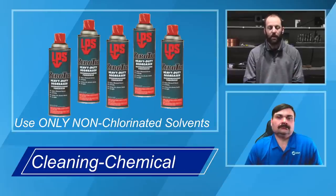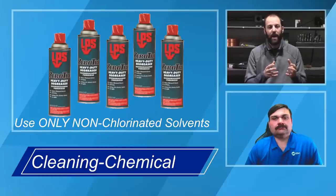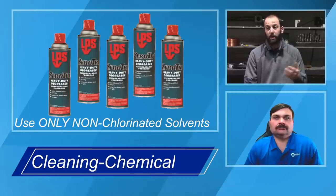They were still doing some of the mechanical cleaning things after the water bath in order to help ensure that the welds were successful. So there's always a trade-off of cost and risk that has to be weighed out in the preparation sequence. And for most companies, the cost of bringing in some sort of an acid and all of the safety protocols that come into play with that, and then washing it in a water solution, disposal of any of those materials, certainly is usually outside of the scope for your average company. And so therefore, some of the stuff that we're going to be going through today is a little bit more basic and can still provide very good results if done properly.